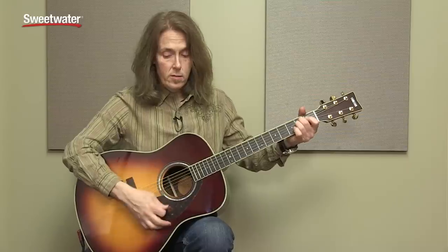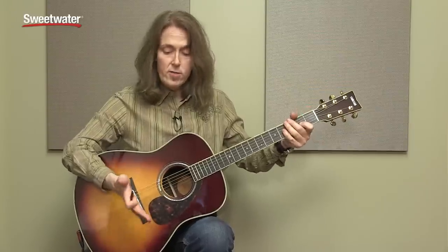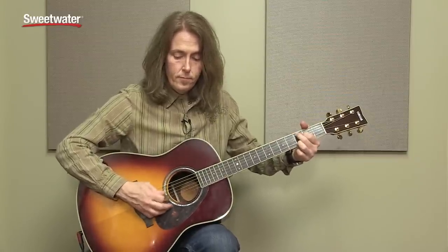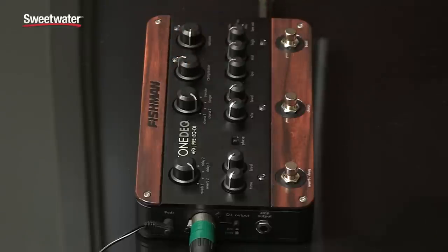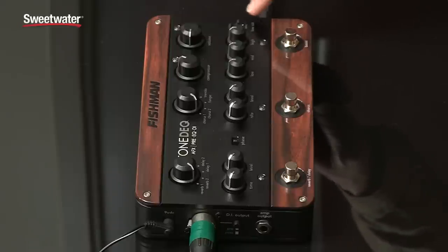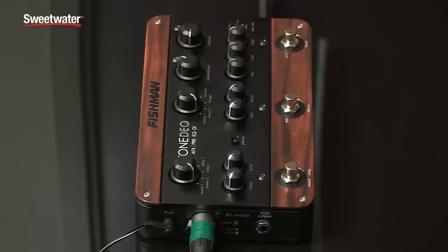And here's with the EQ portion engaged. And even the compressor — you can see that it's active, it's kicking in a little bit. I can roll that out. So it's just designed really to take the peaks off. The options on the low cut are 40, 80, or 160 hertz. I've got it set on 80 hertz. Anything much below that is kind of rumbly — definitely anything below 40 hertz is certainly rumble and feedback and noise. In certain live applications you may want to even use the 160 just to keep the low end out of the guitar so it doesn't feed back. The EQ points are set really nice — I'll dial around on them so you can hear them.